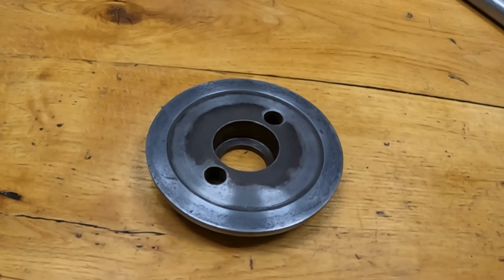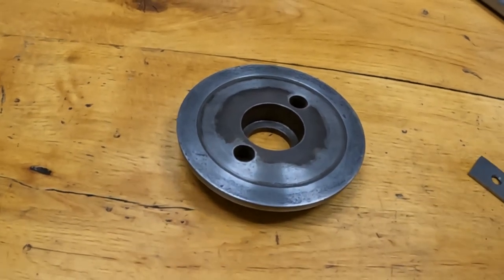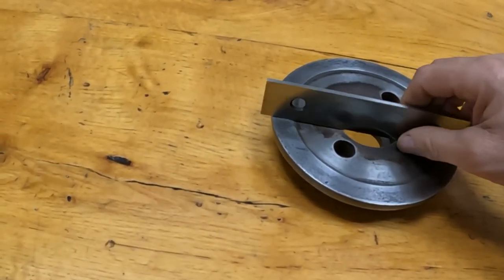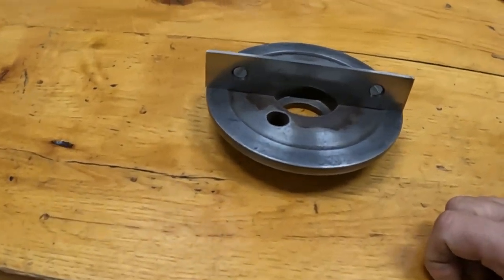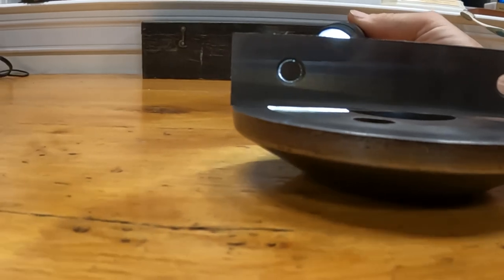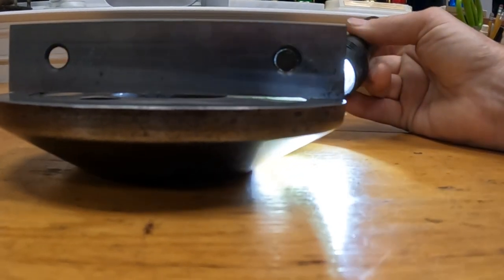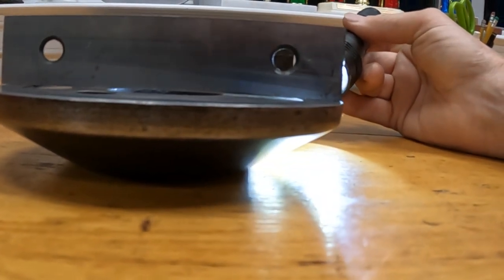But what happens is after three thousand hours of use — this thing's been used for about 20 years — these no longer have that small taper. You can put a feeler gauge under here, but frankly that's a waste of time. If you look under the edge of this collar where the light's shining on that flat surface, there's absolutely no gap. The two-thousandths feeler gauge is tight. There's no clearance whatsoever — that's not the way it's supposed to be.